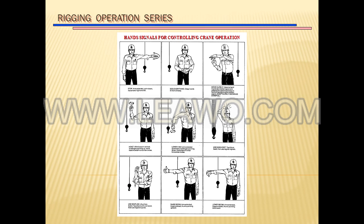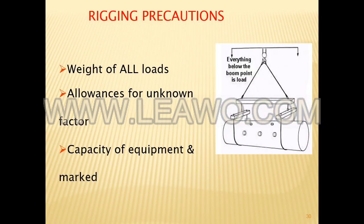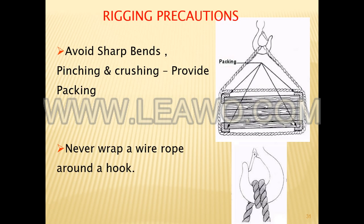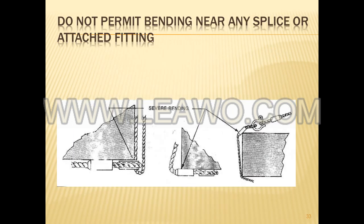Wear on areas that are in contact with hoist sheaves and drums. Corrosion from lack of lubrication and exposure to heat or moisture — for example, wire rope showing signs of pitting. A fiber core rope will dry out and break at temperatures above 120°C (250°F). Fatigue from repeated bending even under normal operating conditions. Overloading the safe working load limit — follow manufacturer's charts.